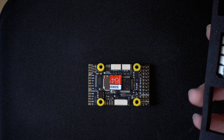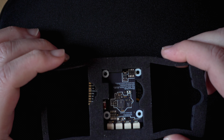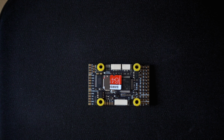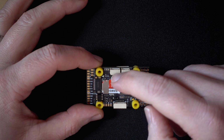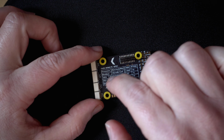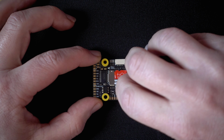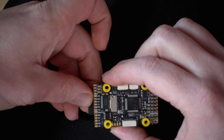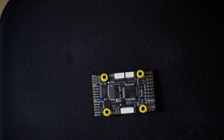And the connections on that top board, there's 2 blocks of 8 and they're quite small. I'd worry about damaging them if I was taking that on and off all the time to get the SD card out. So yeah, if we'd got rid of these connectors or got rid of these connectors, there's plenty of room here now for an SD card reader. So the SD card could have been accessed there. So that's a bit of a silly mistake with regards to the SD card.